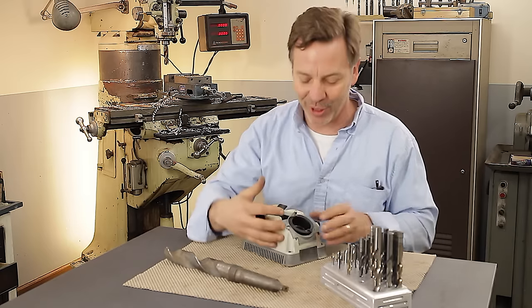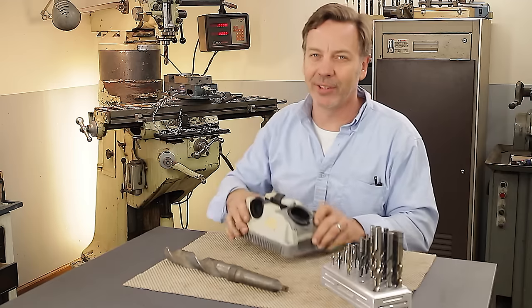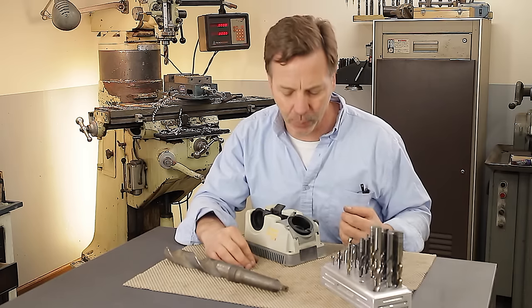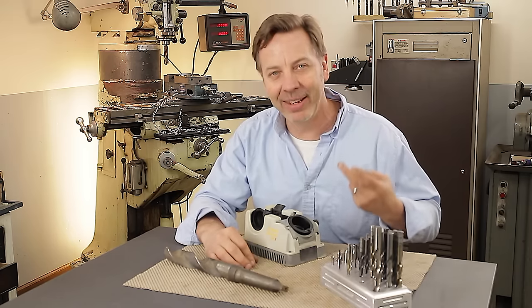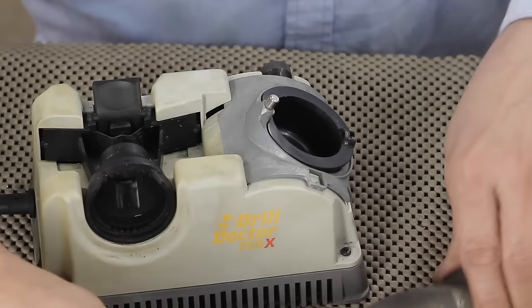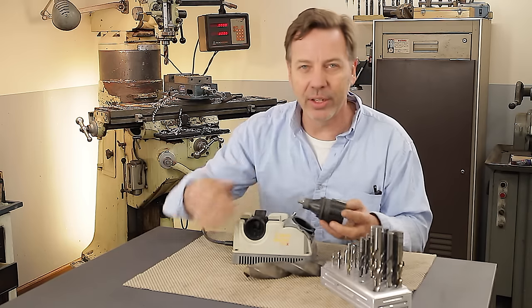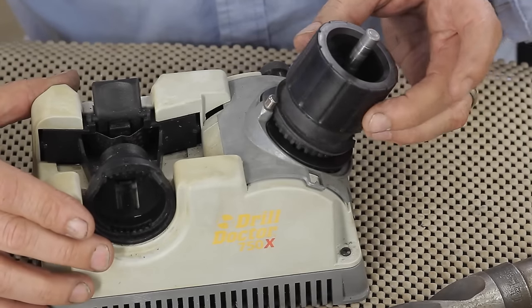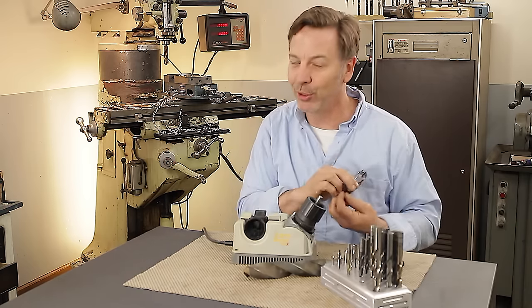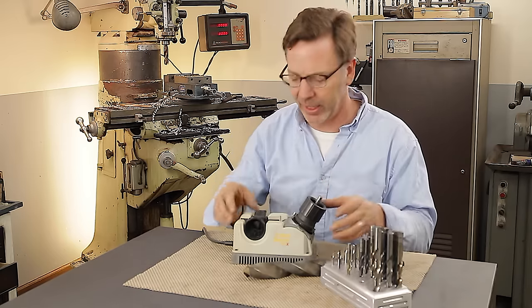On the business end, this is where the grinding chamber is. Inside there's a diamond grinding stone, which is probably one of the most effective grinding wheels you can have because it shows very little wear, lasts a very long time, and can sharpen both carbide and steel effectively. When the chuck goes in it actually rocks a little bit, and that rocking is controlled by a cam right here — you need to learn how to take advantage of that. When you put it in, press it up against this pin and control the tension there. Since we have two edges, count to two over and over again to keep the cutting lips the same size so both are cutting equally when you drill.